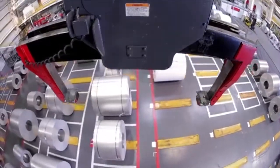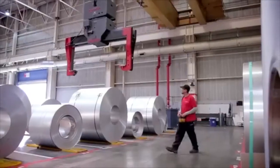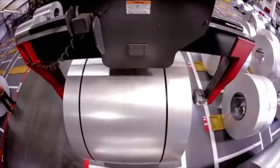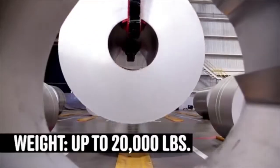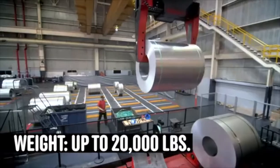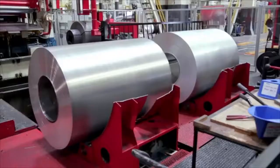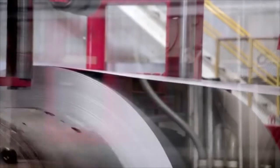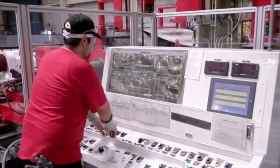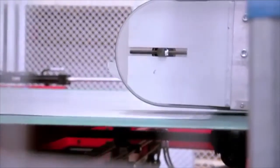The modelist process stage — it all starts with raw material. We have coils of aluminum, different gauges, different types of aluminum, maybe 50, 60 coils. We start the process by uncoiling the coils in a special machine we call a blanking machine that allows us to flatten the metal first and then cut it into flat pieces. We call them blanks.